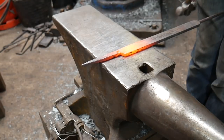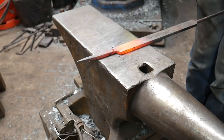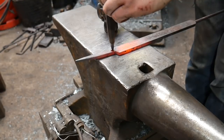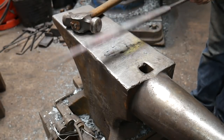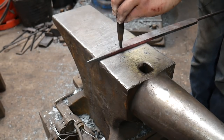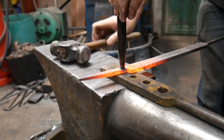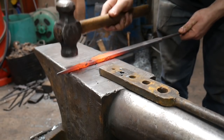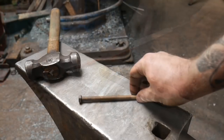When your material's hot, find your center dot, give it a tap with your punch and have a look. If you're happy with the location give it a second go. Punch through about two-thirds of the initial thickness, then flip the material over, find the shadow or shine spot where the punch came through from the other side, and knock out a loose slug. Take the same punch and slightly open the hole a couple of times on both sides, keeping your material nice and straight. A good brushing always helps.